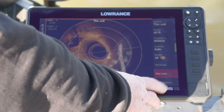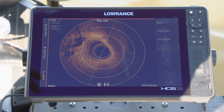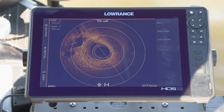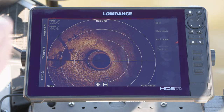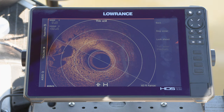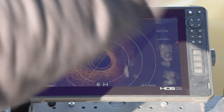The last item on the menu bar is More Options. At the top is Stop Sonar. When stop sonar is enabled on Ghost 360, remember it's coming from the active imaging 3-in-1 nose cone — so when you stop it here, it also stops side and down scan at the same time, and vice versa. Look Ahead is an option that zooms in on the image a bit, giving you more of a wider view of what's out in front or to the sides, reducing focus on what's behind the transducer.